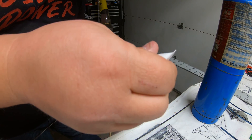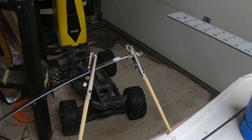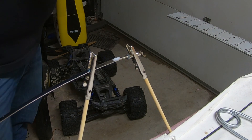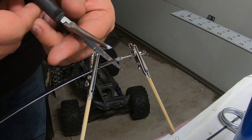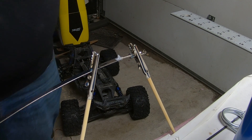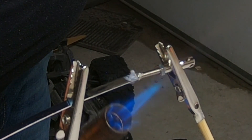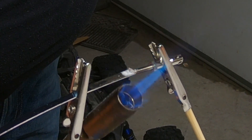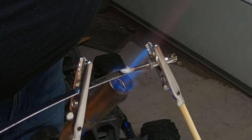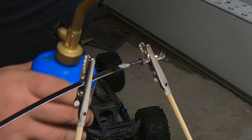I'll take my flux and put a little on — you don't need a lot. I've been taking a little piece of solder, breaking it off, and getting some flux on it too. I'll light it, melt the flux, then take that little bit of solder and lay it down right there on the wire. I'll heat the screw side — you'll see the flux start melting off. Watch that solder piece disappear, and as soon as it disappears, pull your heat out. That should be a well-soldered end.